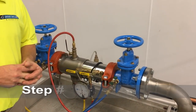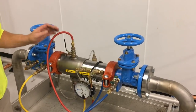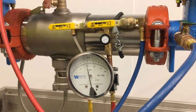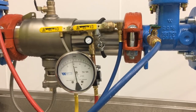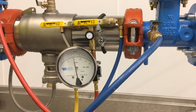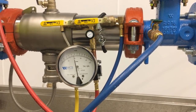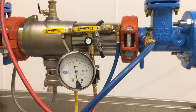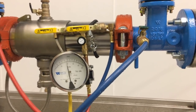The last and final test is testing shutoff valve number 2. While observing the gauge, close test cock number 2. The gauge needle might drop slightly but should remain static if shutoff valve number 2 is drip tight. If the gauge needle continues to drop toward zero, then shutoff valve number 2 is leaking. We'll also open a downstream fixture from shutoff valve number 2 to create flow and accurately determine if it is holding tightly. Record shutoff valve number 2 as passed or failed on your form. If it is leaking, you must repair or replace the valve and repeat all tests. Then open up shutoff valve number 2.